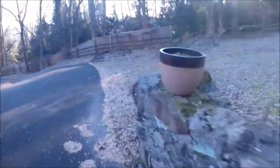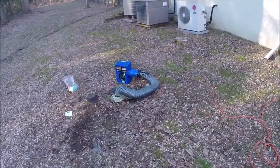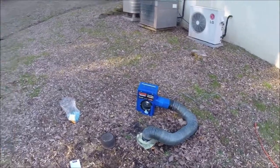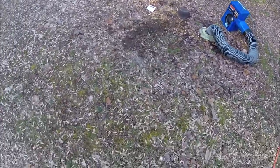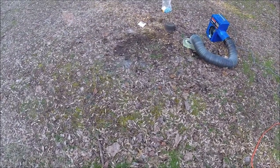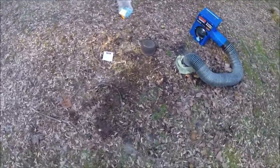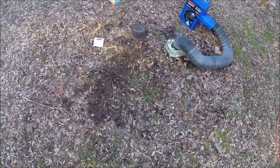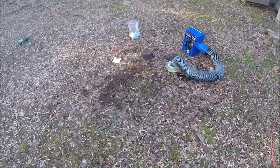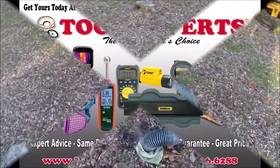Coming back outside now. The candle is just about done. I'm also seeing some smoke coming through the ground here, which tells me we might have some issues with the septic system. Clearly the pipe running to the septic tank is fractured, as the smoke is coming right up through the ground. So we've got some bigger problems here than just that scent in the basement — and only a smoke test could have told us that in 5 minutes.